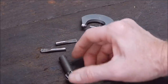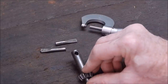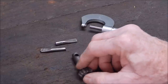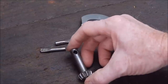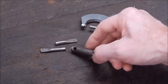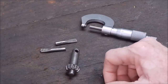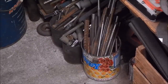Today's project is I'm going to machine up a new little crossbar to go through there. By estimation it looks like it's six mil. I haven't got any six mil rod, and it'll have to be hard — we can't really use mild steel on it. I'll need something a little bit tougher, so I'll look in my scrap bin and see what we can find.